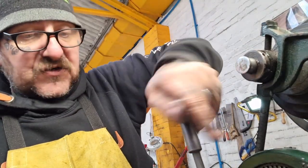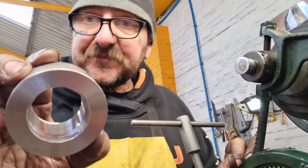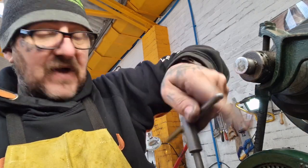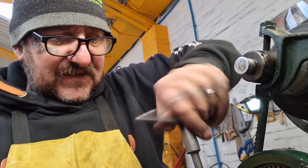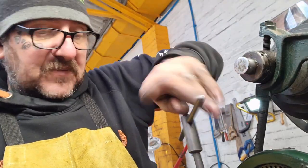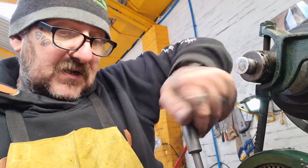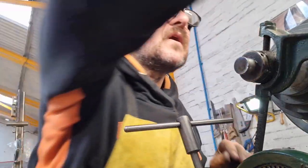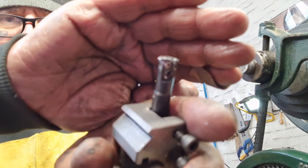And I'm going to just set it up just the same as the others. I've already done the relief hole. I've already done this to size. It's a rough pitch thread as well, number eight. It is what it is. I've got the machine set, as you've seen, and I'm gonna screw cut it, because I found a tool that takes carbide inserts, if it'll focus.